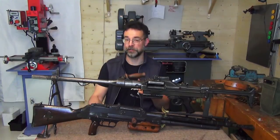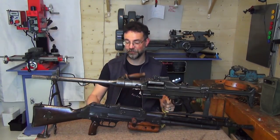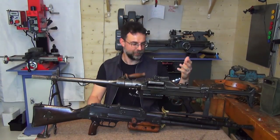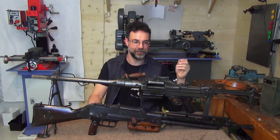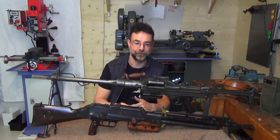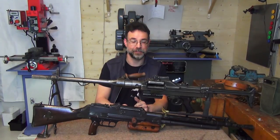And last of all, of course, the general requirement: it should be easy and simple to manufacture. Also, the preference is explicitly expressed for minimizing machining operations, so there's minimal use of lathe operations, but to maximize the use of things like stamping, sintering, casting, obviously wherever appropriate. And you can clearly see that they really went to town on this firearm just on that requirement.